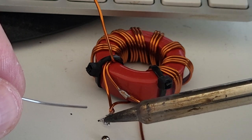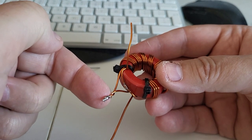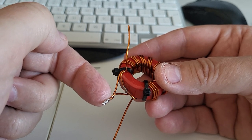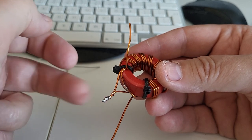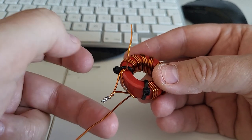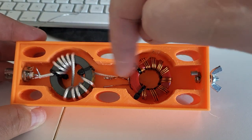We are left with three connections: the antenna wire, the center of the BNC (which will be the center of the coax coming out of the choke), and the ground of the coax (which is the ground of the BNC in the case of a single-toroid unun). Now we have our two toroids ready — the 9-to-1 unun and the choke — and I need to connect them. Now it's time to modify the case so I can put a ground connection.